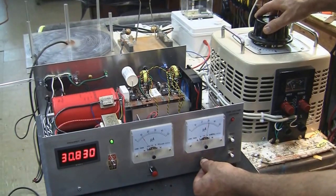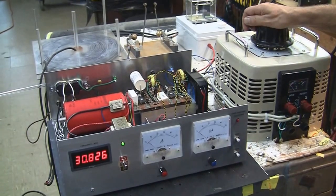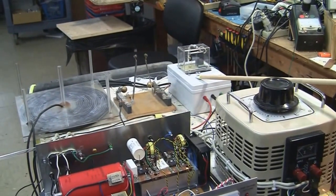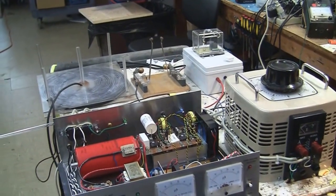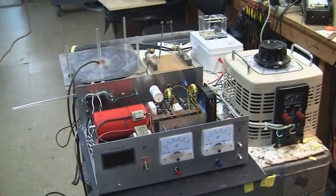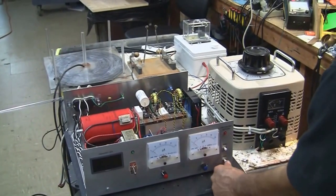Now this load has a very small amount of real resistance — it's strictly a complex load. The complex load is the combination of reactive components: the test capacitor and the inductance built into the oil-filled transformer. At resonance the two reactances cancel out, and the only thing controlling the current is the resistance — the load generated by the plasma corona discharge between the capacitive plates. That's the real part of the equation, and that's what you want to generate.